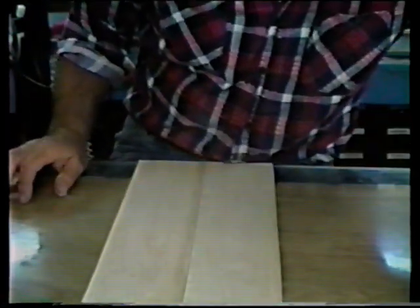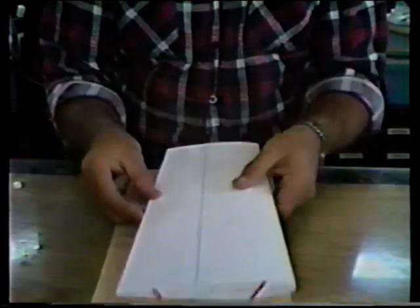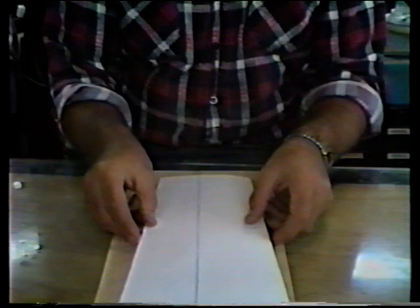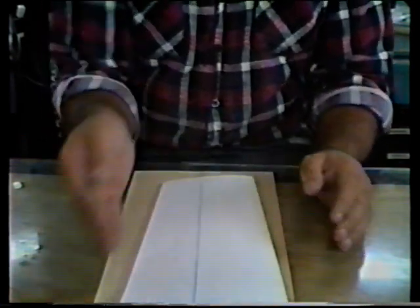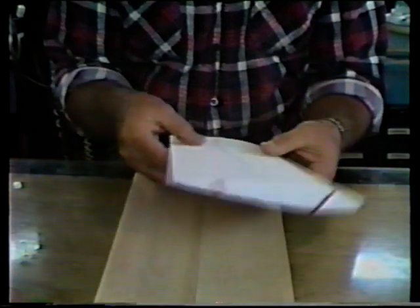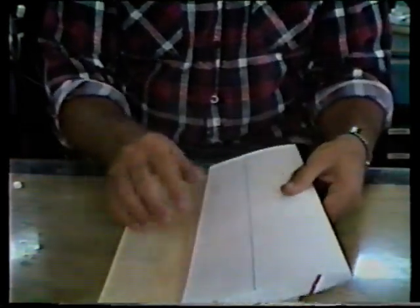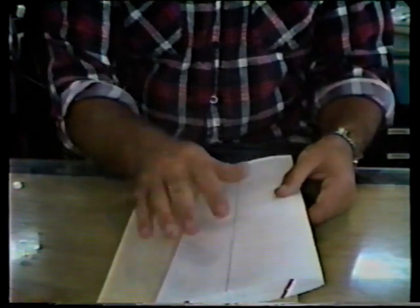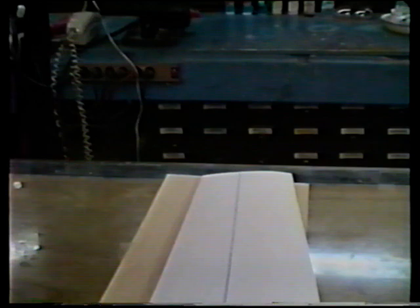We'll take one of the cores. And when we glue this, we're going to spray the glue on and just try to line that up. Line it up and rock it back and forth. Trim it off and do the other side. Now I'm going to have to spray this glue outside. This glue makes me sick to my stomach. I'm going to take these, blow them off a little bit, blow the final dust, spray some 3M77 cement,